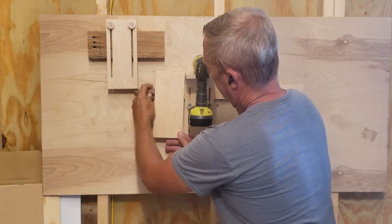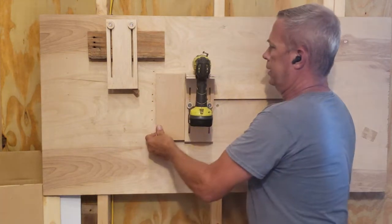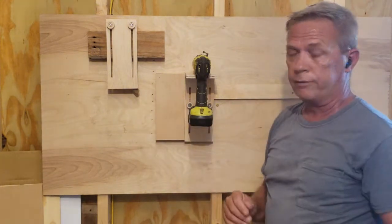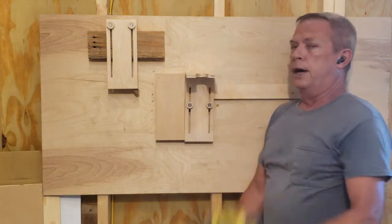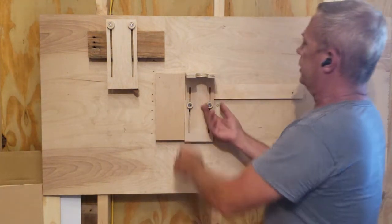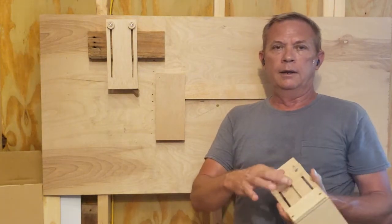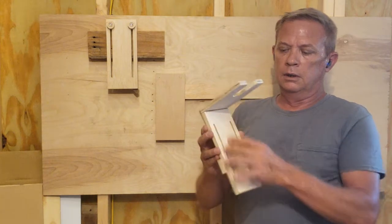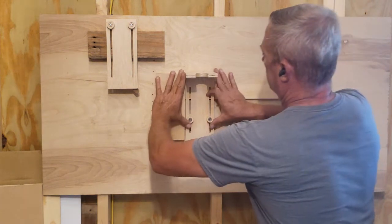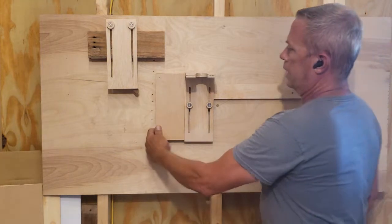This is great if you have room to the side, but let's put it over here where it's close to another one. It's locked in again, not going anywhere. I can get to this one and take it off, move it around, do whatever I want. But if I want to do something here where there's no clearance, I have a different solution: a cleat stop. If you've dealt with stop blocks anywhere, there you go — built into the tool holder. Same cleat, you need no clearance. Move the stop up, tighten it down, and now you've got two that aren't going anywhere.